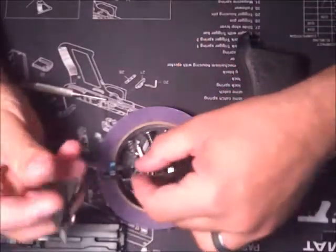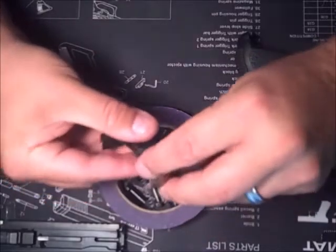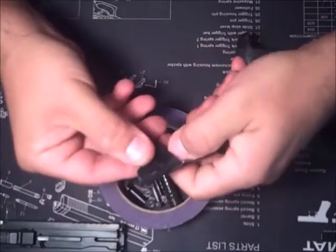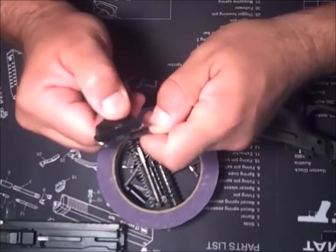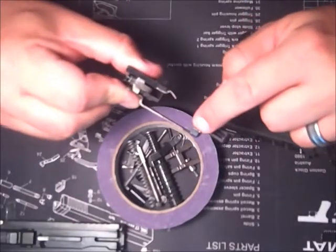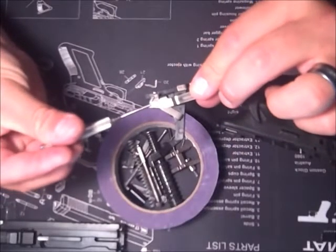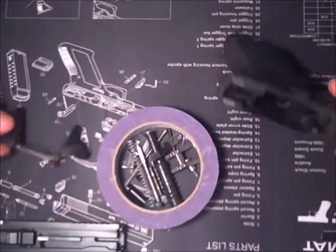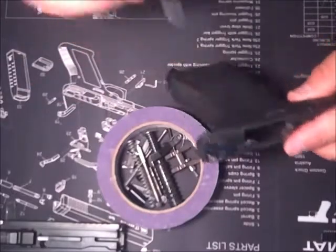Okay, reassembly. We're going to hook our trigger spring, pull it back over so it's in, pull it down, turn it sideways so it goes into this notch — see how it fits right in that notch? You have to put it in at an angle and then let it come back. Now this is ready to go back in. You can clean this up with a toothbrush but don't try to polish it too much except on this radius. You can put that in — slide it straight down, done.